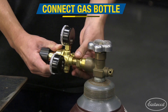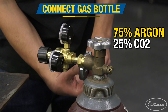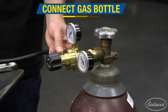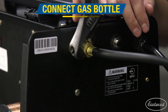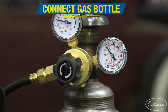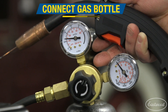If this is the first time you're setting up a MIG welder in your shop, then you'll need to get a bottle of welding gas. When welding mild steel, you need to have a 75% argon, 25% CO2 bottle. Attach the provided gas regulator to your bottle and tighten it down. Using the provided gas line, attach one end to the regulator and the other end to the back of the machine. Here's a tech tip: these are brass fittings, so don't over tighten the connections. You also won't need Teflon tape. Set the gas flow at the gas regulator — with the machine on, pull the trigger and turn the adjustment knob until it reads 20 CFH. This is a good baseline for your gas flow.